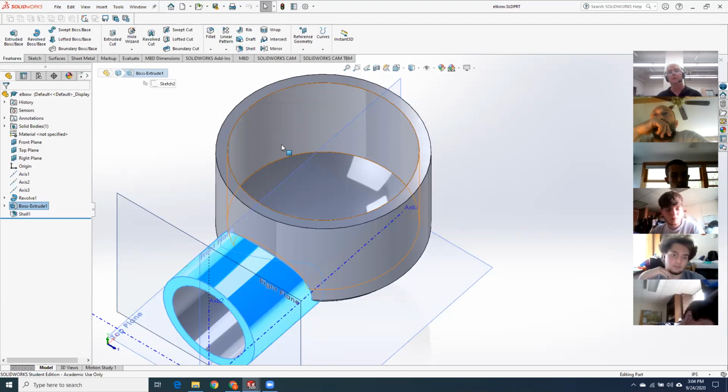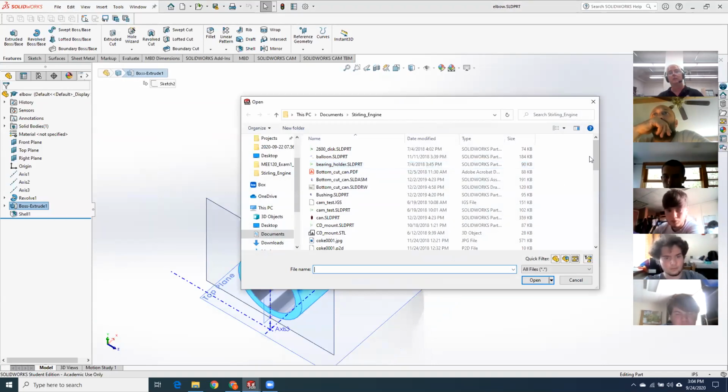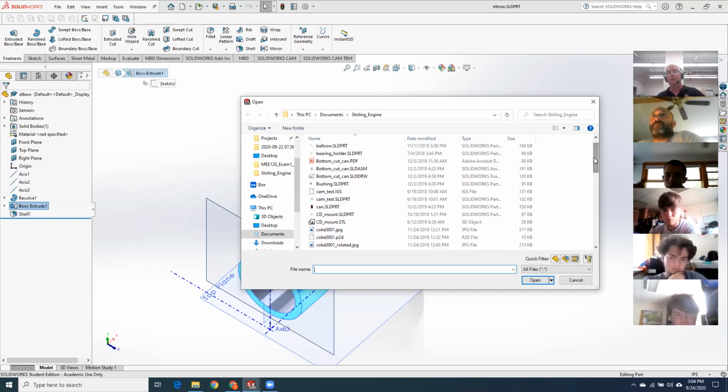Okay. Also, for the wires, do we need to draw them with all of the curves and twists and whatnot, or do we put those in assembly? No, absolutely. I want to see every last twist, bend, everything. So the assembly doesn't alter any of the parts. There are some things that we are going to modify at assembly, much as if you were doing a weldment. But all of the wires should be bent on the table and then get slipped over and installed. So you're not going to bend the wires at assembly. Okay.